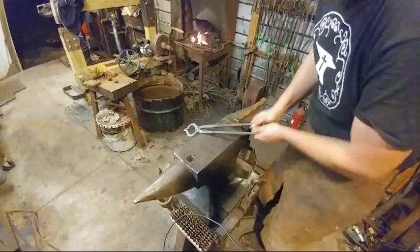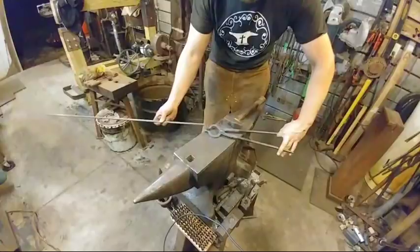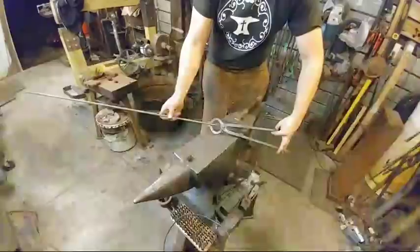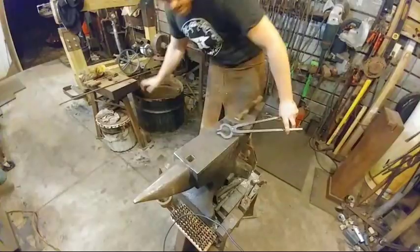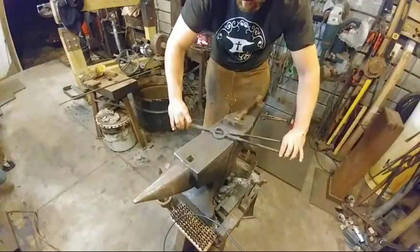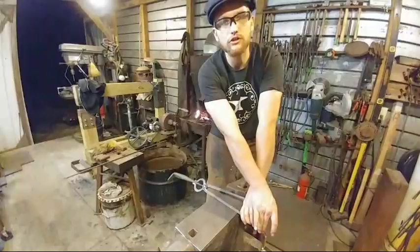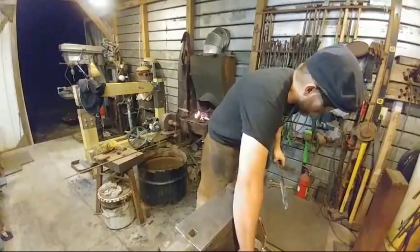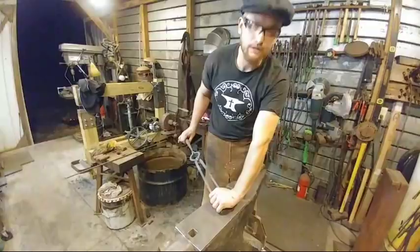Oh, I want to go back to, was it J.G. Clark that asked about the tong sizes, readjusting them? No, it was somebody else. Let me see if I can find it. I don't know who asked the question about readjusting the tongs each time, but these tongs here can actually hold quite a multitude of different sizes. So that's 3/8 round. We adjusted it to hold 3/8 square perfectly. So it can hold 3/8 round, but you can also hold odd stuff, like so, in these tongs. That's more than 3/8 there, and it's on a taper. The only difference is back here at the reins, they just open up a little larger as you go bigger. Then, of course, you can grip a lot smaller material. I can grip all the way down to that small of material with these tongs. It's just that the handle reins are a lot closer, so you have a lot less squeeze to them.